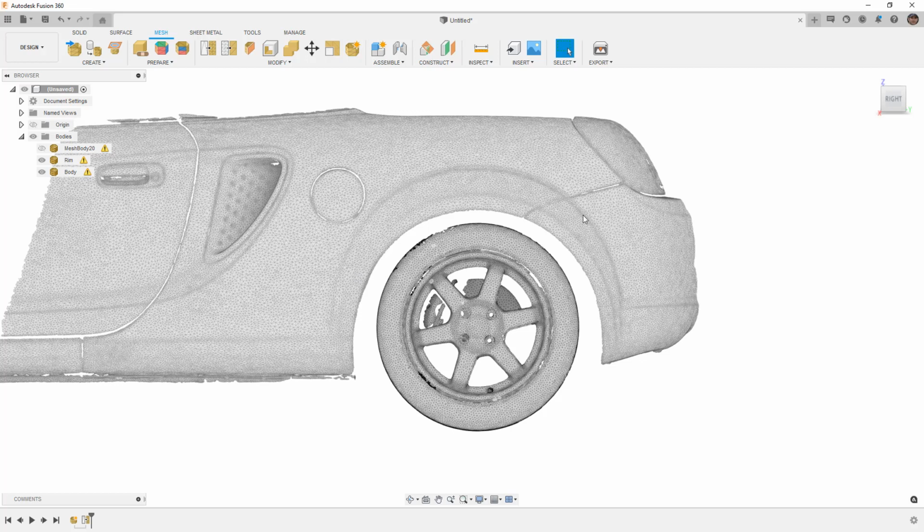Now, with the MR2 and with a lot of more modern vehicles, portions of that are actually plastic and part of the bumper, so that's a little bit easier to cut. The metal is a little bit trickier. You need to make sure that you prepare it if it's steel so it doesn't rust or get water in between, because a lot of times inner and outer pieces are welded together and then they're folded and rolled under. So you have to be real careful when you cut that.